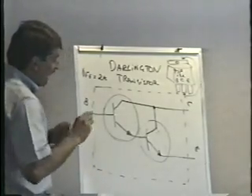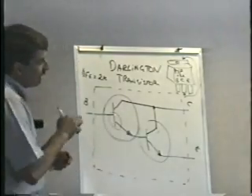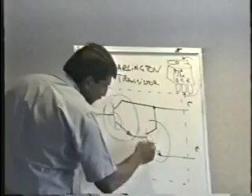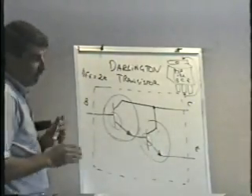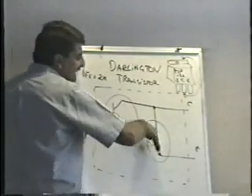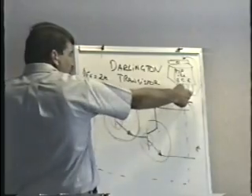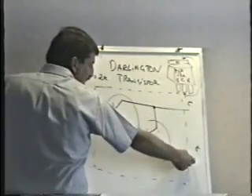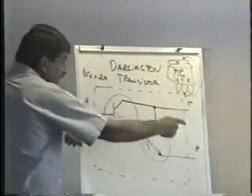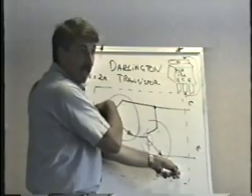The reason for that is that you have a P-N junction between the base and the emitter in series with the base-to-emitter junction of the second transistor. When you're going from base to emitter, you're going through one P-N junction in series with another. When you reverse the leads, though, that's perfectly normal — open reading, open reading, just like before.